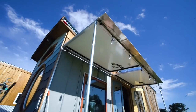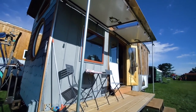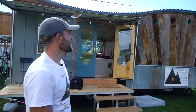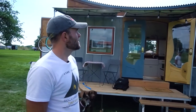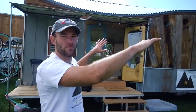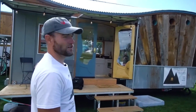On the rear part, it's what I call 5V crimp — some people call it 5-star. It's a real popular roofing for barns and agricultural buildings, and we found some in Denver at a repurposed store. The roofing is all new material — I don't like to put reclaimed stuff up there, I need the durability. It's corrugated 7-8 corrugated, 26-gauge, a little thicker. We thought it would be troublesome bending it to the radius of the roof, but we just started in the low spot and worked our way out and it conformed nicely. It was a gentle enough slope that it fit.